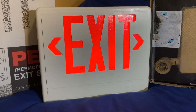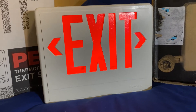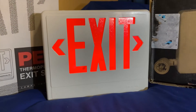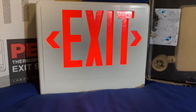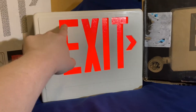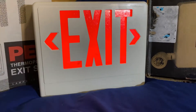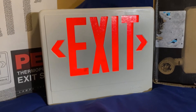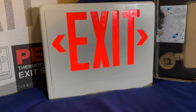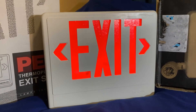This particular PEX-H unit also had an L variant — the PEX-L — which means it has LED optics. You could get the super bright optic and a light strip on the bottom as well as at the top of the sign, giving a lot more illumination. However, the fact that they used the same diffuser in the PEX-L as the standard incandescent version meant the LEDs weren't really designed for it — it wasn't optically superior performance-wise. You could offer that super bright option and get a second light engine mounted at the top of the sign for more brightness.